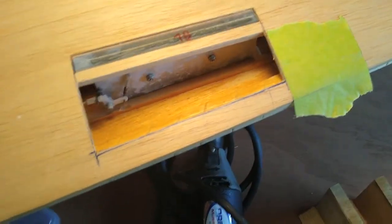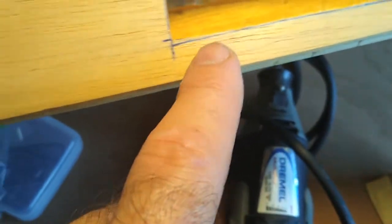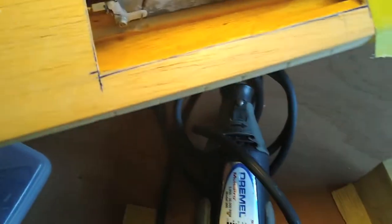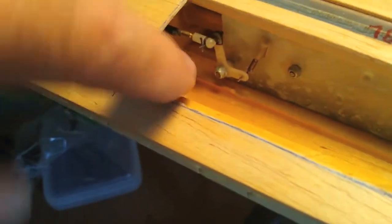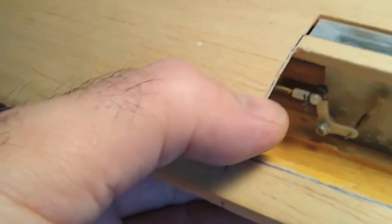Now the hatch is a little bit further along. I've squared the edges — unfortunately I didn't have a straight edge on this, so that line is a little bit off. I'm going to sand it a little bit. Everything is close to where we need to be. I'm going to have to make a rib to go in here to support this piece of wood, because I've already cracked it — you can see right there. And another support right up in here.